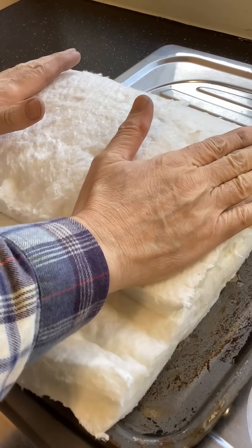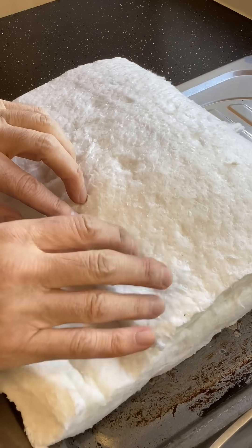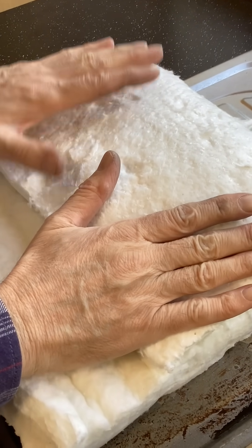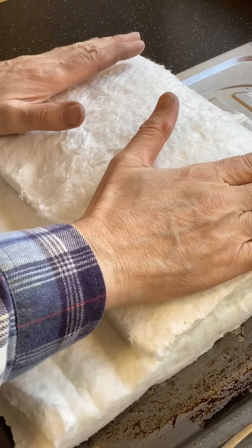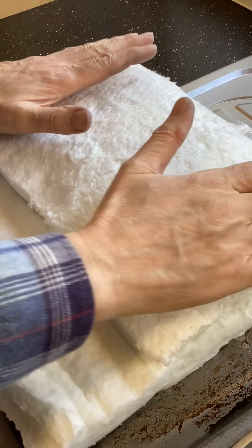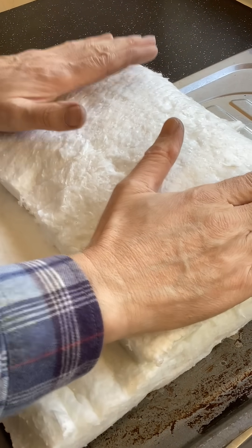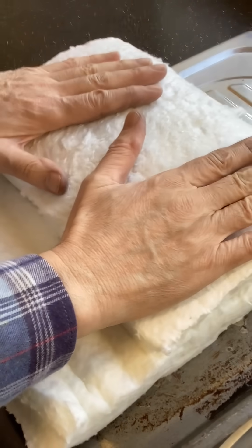We used a blow lamp outside, reaching about 800 to 900 degrees centigrade, with the steel wrapped in a ceramic blanket. It took about 10 minutes to heat the pieces to red hot. They'll cool down slowly, and apparently this improves the magnetic properties when you make your electromagnets. I don't know how marginal it is, but seeing as it's fairly easily done, I thought we may as well do it.